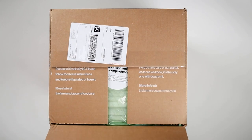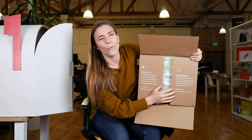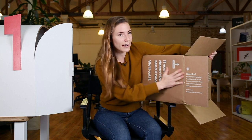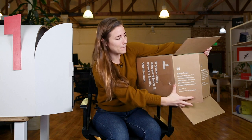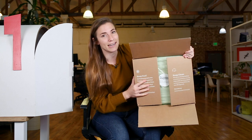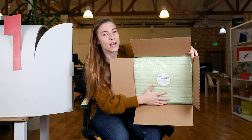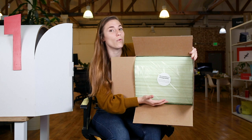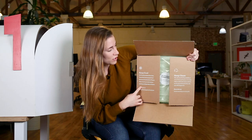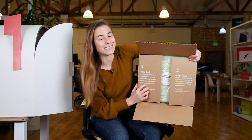I'm going to slice this side open — and there's some messaging right here on the interior flaps. I love the usage of a good flap print. The flap is actually part of the outside surface of the box, which might sound counterintuitive. It looks like I'm looking at the inside, but this is on one panel, so you can do one-color printing on the outside and print the flap right here so people see it as messaging. Very efficient usage of printing — you don't have to print the other side of the box. This brand, Farmer's Dog, is using one-sided, one-color prints, but they're getting messaging to you right here when you open the box. It says 'keep cool' with instructions for how to keep it cool, and 'keep clean — we only use biodegradable, recyclable packaging materials,' giving you information about how to recycle and how to take care of the product itself.